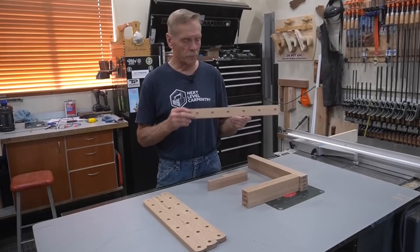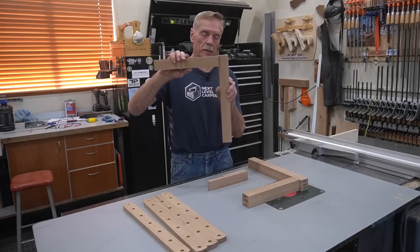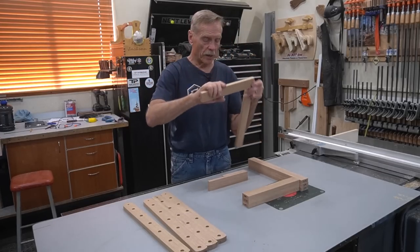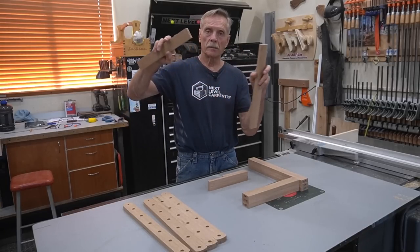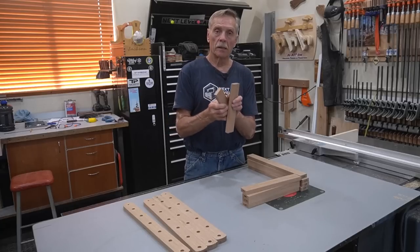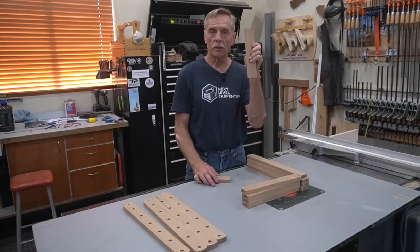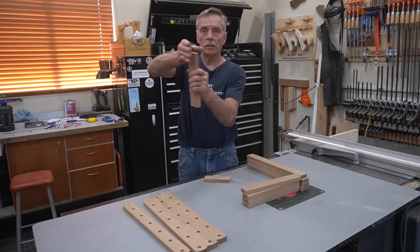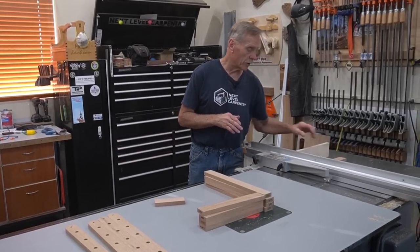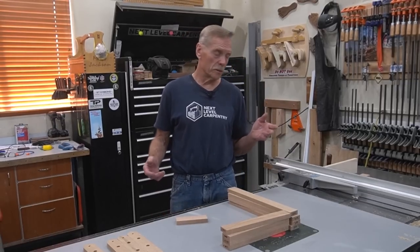There are a couple of minor things still to do on the arms, but the heavy lifting is done. I'm going to switch to the support arms that hold up the drying rack — a horizontal and a vertical piece for each arm that pivot in and out. To make the connection at the top corner, I'm going to use a bridle joint. I have a scrap to represent the horizontal and vertical pieces, and I'll start by cutting the shoulders on the vertical piece so the horizontal piece has a mortise that holds it, making the horizontal piece stronger.